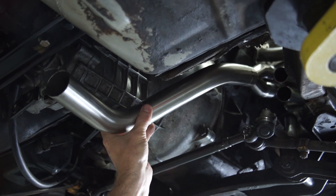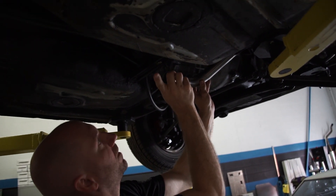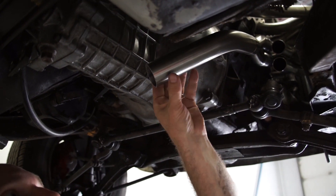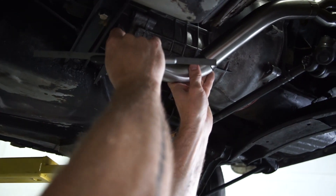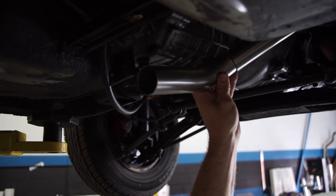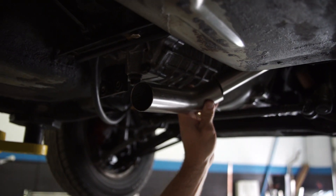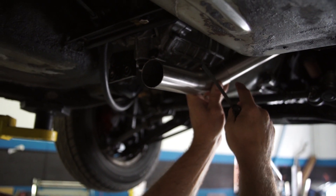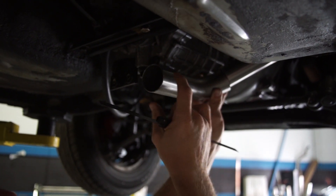They're nice and low profile too. That's getting closer — I need to cut a little bit more off this radius. You can see it's pointing a little bit towards the passenger side of the car; I want to straighten that out. There are tack welds at the other end of the 45 — if I need to turn this down a little bit more, I'll just break those tack welds, turn it and continue on. I want this pipe to live about there. Right now it's below that because this leg is straight. As I cut material off of this leg, it's going to pull it up towards the other bend. If you remove too much, it's going to pull it too far and then I won't have room for the second pipe running parallel next to this.